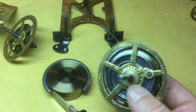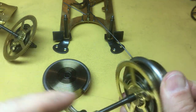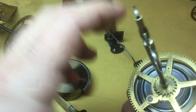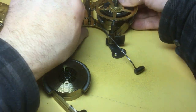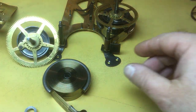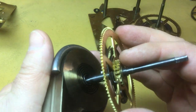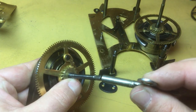And with the help of a winding key, make sure that the center coil is caught on the spring, and I can tell that it is. It's winding up. So this assembly is ready to load into the movement plate. And as you can see, this has popped out already. So we'll do this last. You're going to do the same thing with this one. Assemble it with the help of a winding key.